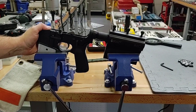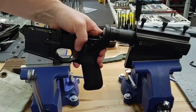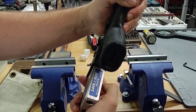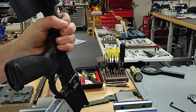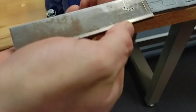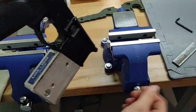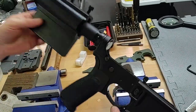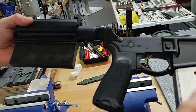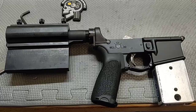So I wanted to share that little setup with you: a Geissele reaction block, the lock-and-hold pivot lock, and a piece of 3/16ths shim material — and you'll have perfect timing of your buffer tube every time. Hope you found this video educational. Thanks for watching.